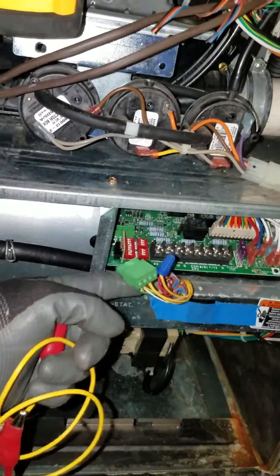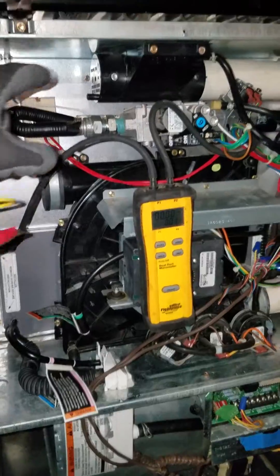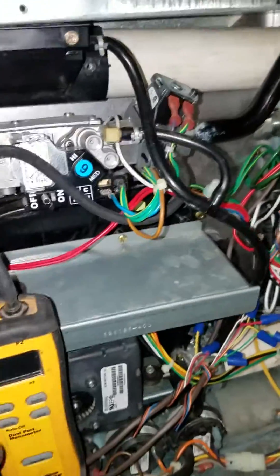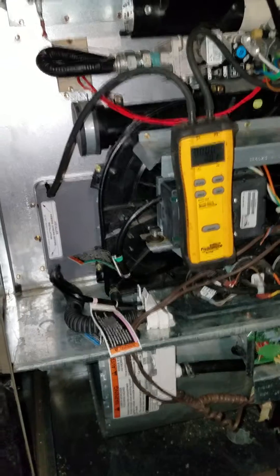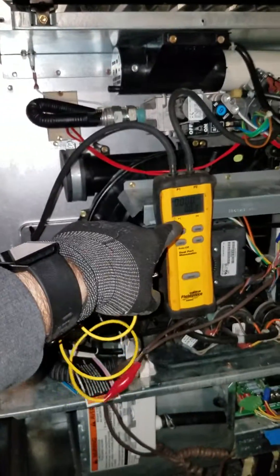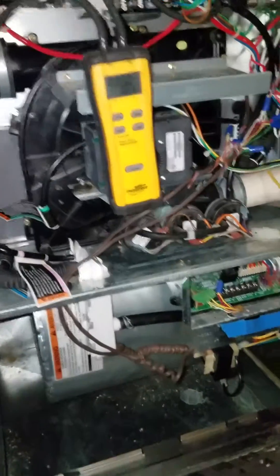Also, don't use communicating. So you open this because when the inducer comes on, it's sealed — it pulls a vacuum on the gas manifold up to where you're measuring. I tried this just a little bit ago and saw a negative 0.6 pressure. So it was pulling 0.6 inches of water column vacuum right there. So you open this up so that it doesn't pull a vacuum. If you make the adjustment with the vacuum on it, then you're actually making the adjustment 0.6 off.